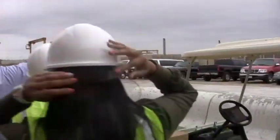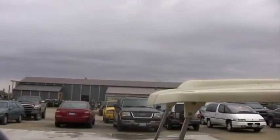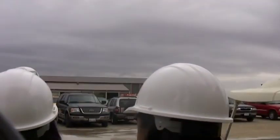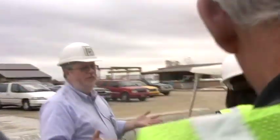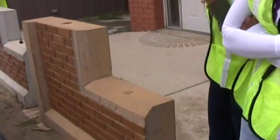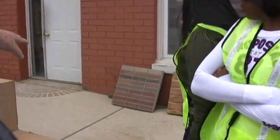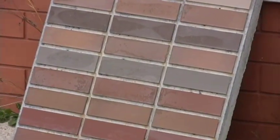Precast operations are on this side of the plant. When you do precast, a typical thing that happens with the architect is they have their design drawings, and then a precaster has to make samples. What you're seeing here is different samples that were made for housing panels. This is a thin brick product, and we used it with an integral color and with a standard gray concrete. That sample board gives the architect different color variations for thin brick panels that he could do.